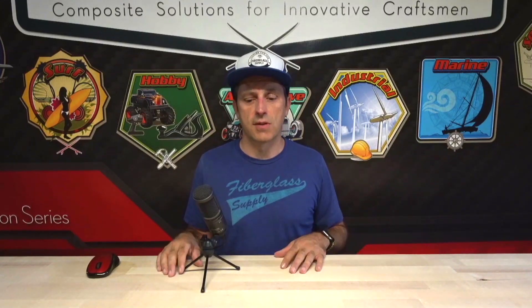Now we're going to let this cure up. In the next video we'll show you how we planed it, trimmed it out, and got it ready to mount to the desk. What you saw here is we went to the CNC machine and milled the hexagons out on the butcher block countertop. The key is that we did not cut all the way through — we left about a sixteenth of an inch of material at the bottom so we could pour the epoxy resin in and it won't run all over the place. Make sure you tape any knot holes and level it up before you pour. In the next video we'll plane both sides flat exposing the hexagons, then mill around the perimeter so epoxy goes all the way to the edge before we finish off the table.